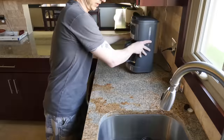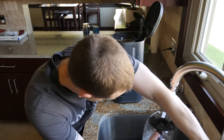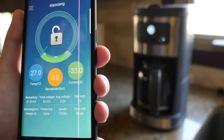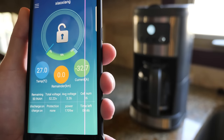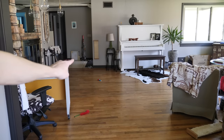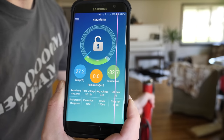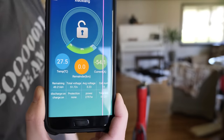We're going to simulate making some coffee. The coffee maker is 950 watts — 12 cups of water, brew started. Now we're pulling 32 to 33 amps total, about 1700 watts. While the coffee's brewing, let's try the vacuum cleaner. Vacuum cleaner — no problem.